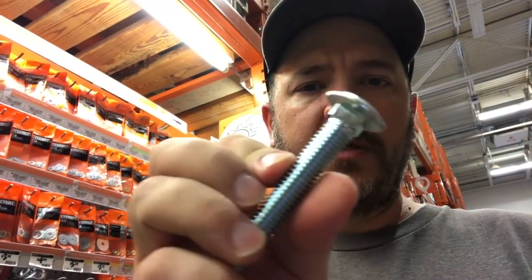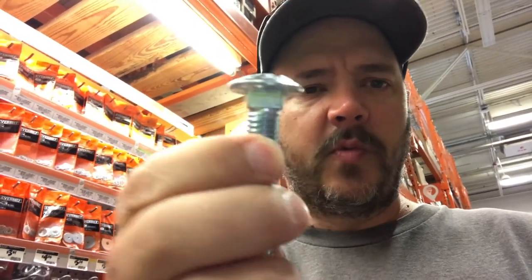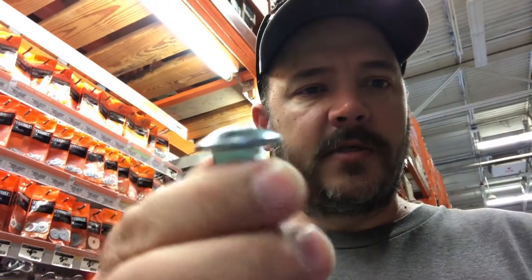We're at Home Depot. You're going to want nuts and bolts for this — you're not going to want screws because you're going through metal and you don't really want to screw into that. So you want nuts and bolts. Make sure you have a washer. The bolts we're going to be using — you drill a hole in your wood, then this square piece you hammer down into the wood, so the wood actually becomes your wrench. Then you put your nut and washer on the bottom and this will suck down into the wood and hold in place. That way when you run over this you won't be puncturing anything, no damage going over it.